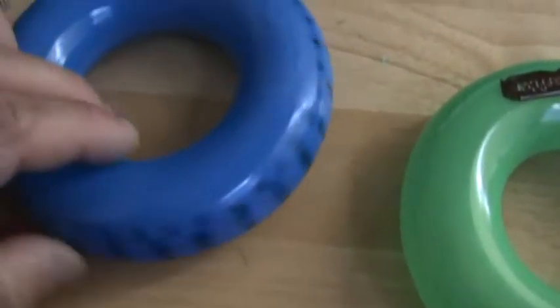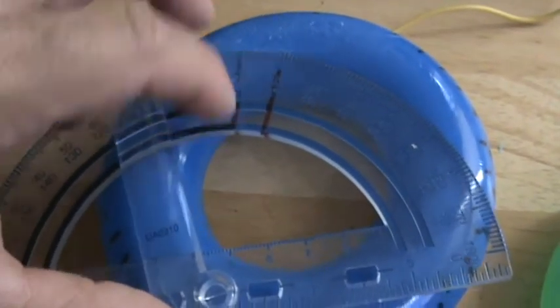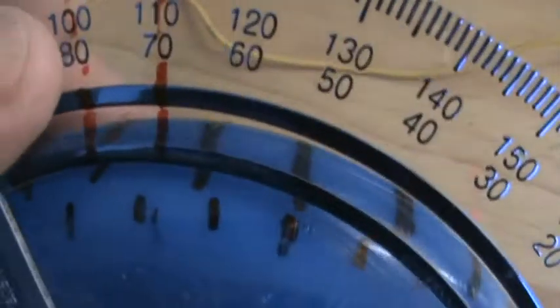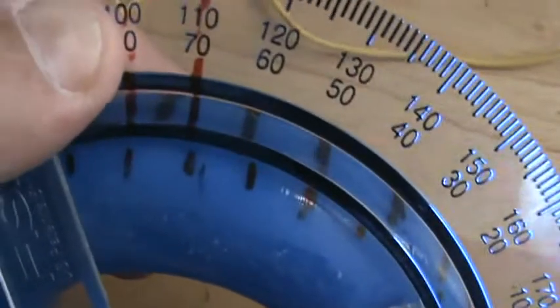So I went the other route — the 10 degrees down here at the bottom. I drew a line from 10 degrees here, drew it straight down to here. And it's just a little bit smaller than 10 degrees. The dark lines at the top are 10 degrees and the smaller ones on the side are maybe 8 degrees. By doing that, I can go around and I can get 36 spaces and 36 markings.